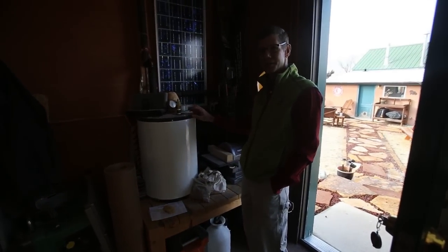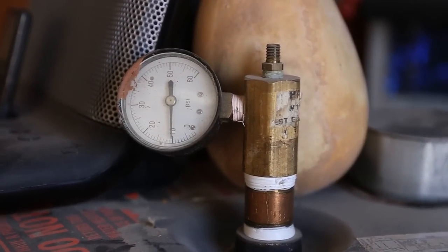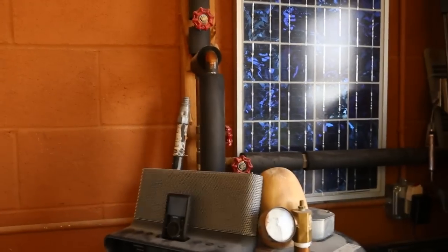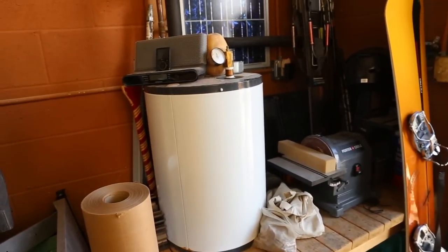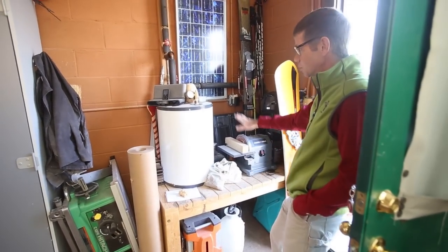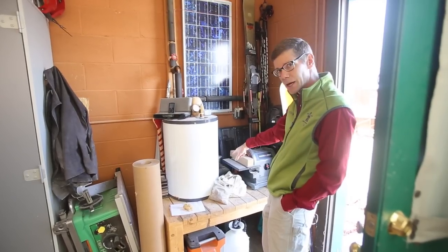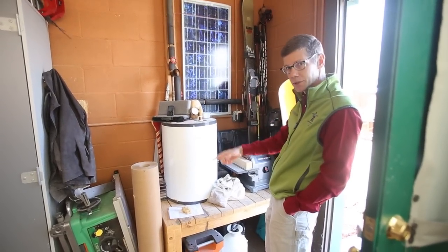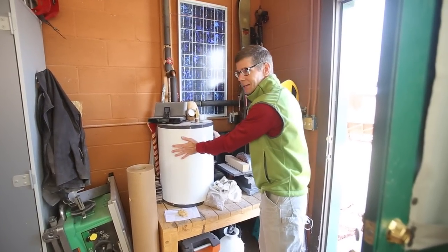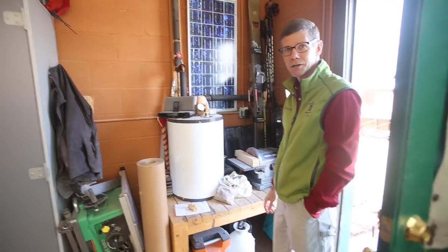This is part of the solar heating system in the shop. The big thermal collectors outside are connected with pipes, and distilled water is pumped through the collectors, then it comes down, sits in this tank for a bit, and then gets pumped out right into tubing in the concrete floor, which is just under the table here. Whenever the sun is shining on the little solar electric panel out there, it runs that pump and circulates the water through the floor during the day. When the sun goes down, the pump stops, and all that water drains back into this tank so the collectors are empty at night. Then when the sun comes up again, it starts all over.